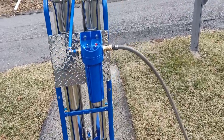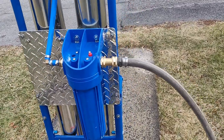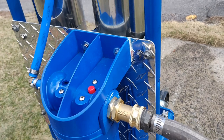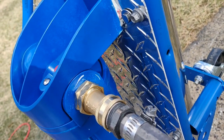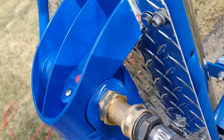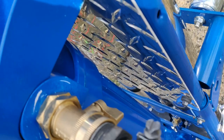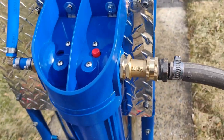Here's the deal. We're going to start front to back on this. You're going to need an inlet fitting for your pre-filter — something that goes from three-quarter pipe thread, or whatever size your pre-filter has, to garden hose. I like this kind that has a little valve on it so I can shut it off, throw it in the truck, and it doesn't leak. It's great.